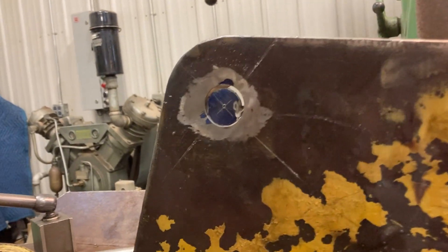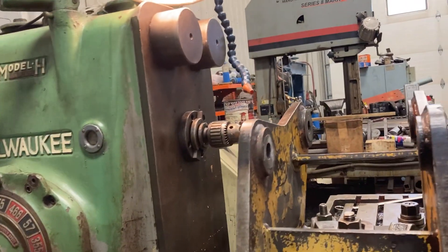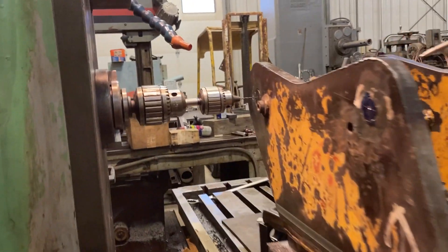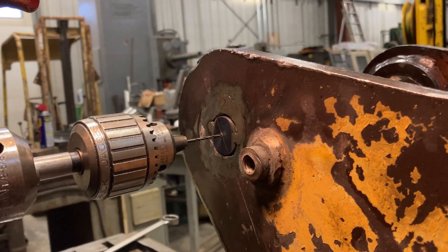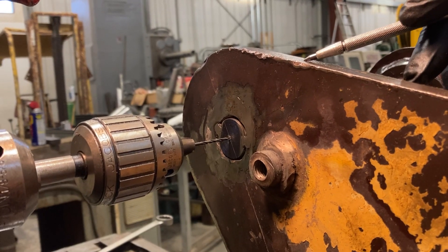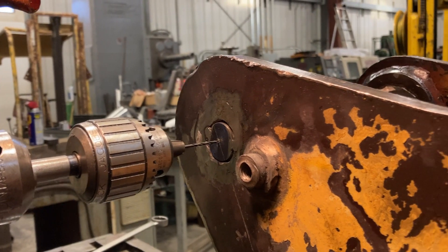You can see we're going to go around the back here and show you some plugs that are in place. We also have a drill bit in there, and we line up X and Z to get our center. Now that that's done, we can just grind the tack welds for the plug and bang it out of there.